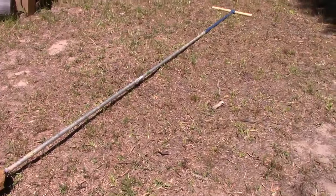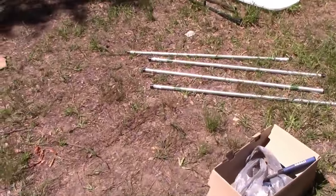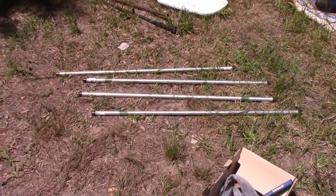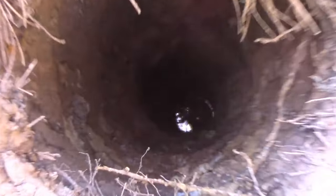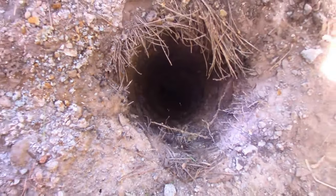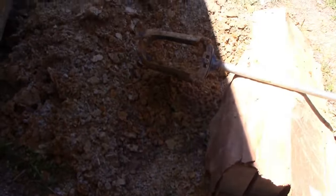We're at about 12 feet, and I've got 4 more chances to hit it. After about 25 feet, the shallow pumps won't work anymore. They can't lift the water. So let us pray. Okay, so at around 13 feet, the water's starting. We got so lucky. 13 feet. Now, I'm going to dig probably another good 10 feet until the sediment changes, and that's the sweet spot.